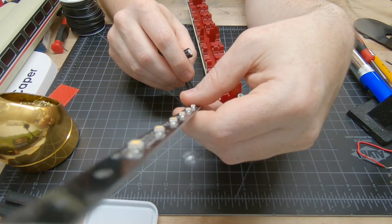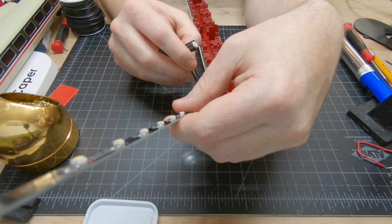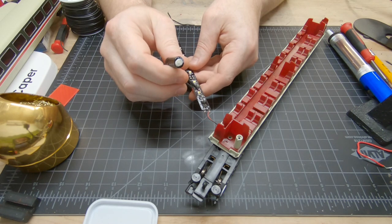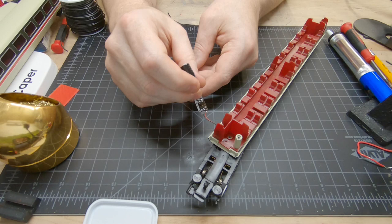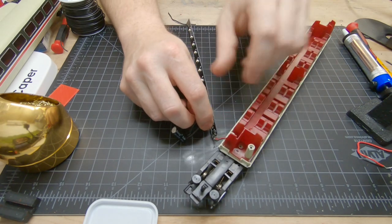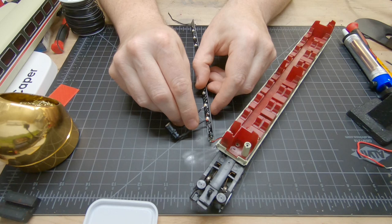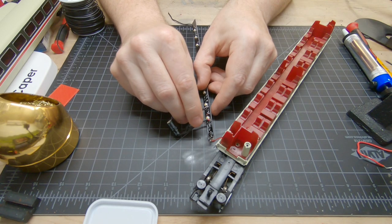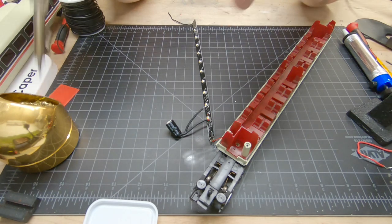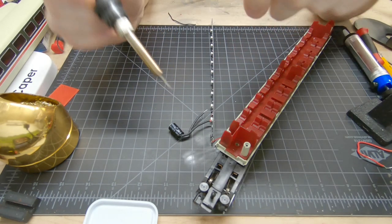Let's pre-test it in the hole again. So what we're going to do next is put the red wire first into that hole. I'm going to pull it out slightly so that there's something to solder to - there's already a pad there. So you just have to be super careful that you're only soldering it onto the pad. The last thing you want to do is break the LED board doing this. And it should go without saying this will probably void your warranty, so if you don't feel comfortable doing this, don't do it.